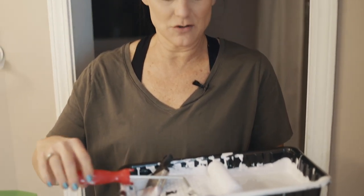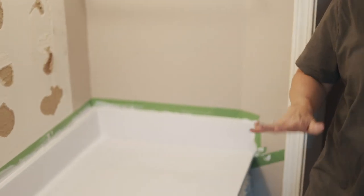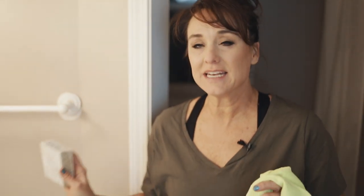It has been 24 hours since we put two coats of this paint on, and I want to explain something I'm going to do a little differently. This is a foam roller with zero nap — it's for a very smooth surface — however when I did it on this counter it did give a little bit of a bumpy texture. I wanted to see if I could get rid of it and I was able to. I took this 120-grit sanding sponge and pushed really hard and was able to smooth out the surface.